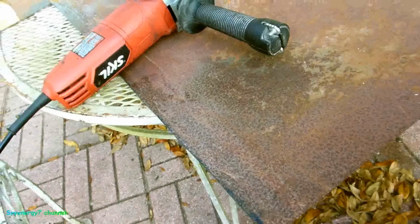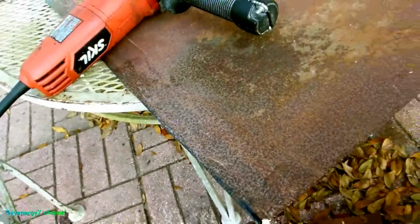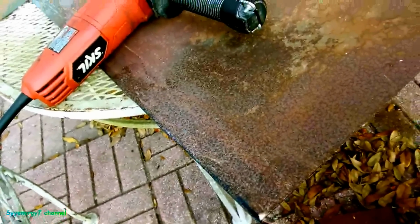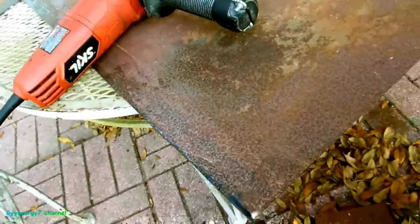The reason, like I said, I'm going to use metal is because if it was out of half-inch wood, I'd have to make a bracket. It would take up a half inch of room between this and that, right? So metal takes up hardly any room. It's extremely strong, and if you put a rolled edge on it, it's going to be stronger. So let me show you what I'm going to do. Okay, so here's a piece of 16 gauge. That's pretty strong stuff. Actually, I don't need to roll the edge on it, but I will, so it'll be incredibly strong.